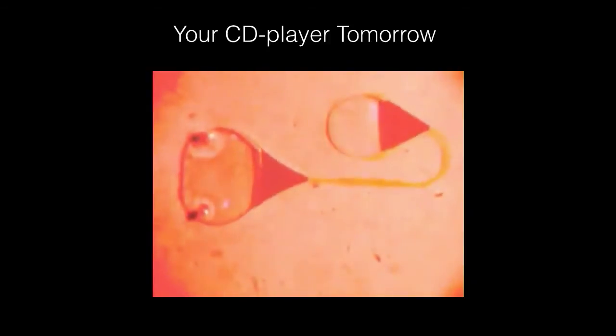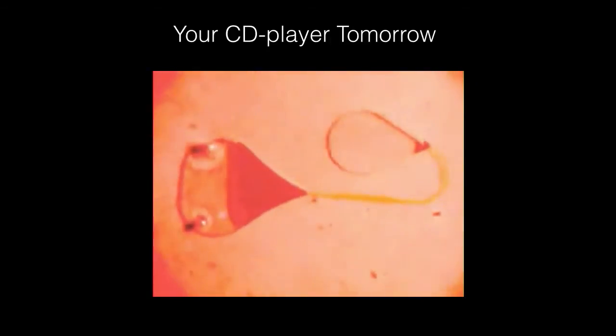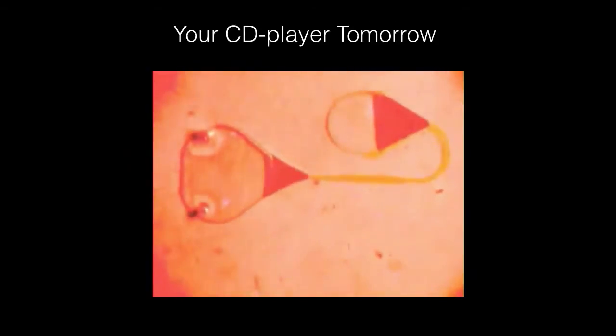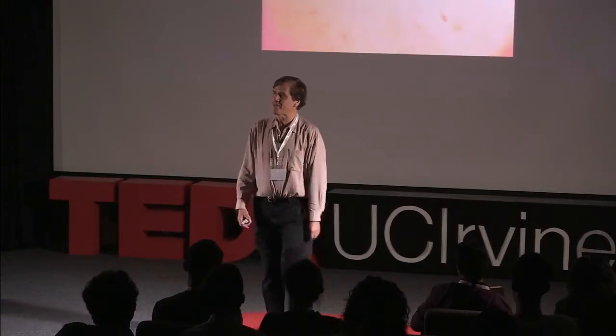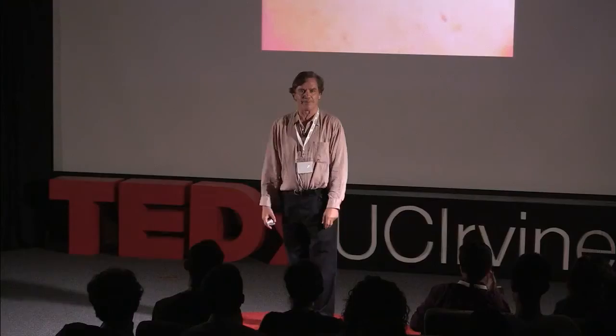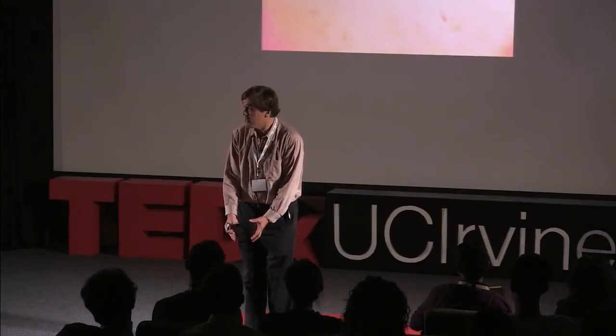The CD player is also a pump. What you see there is liquid being pumped by the CD. This thing is spinning and liquid — mostly water — is pushed by centripetal force to the rim. But do you see what happens? It goes back and forth — it's a reciprocating pump. How is that possible? Over there in that reservoir is air. Here comes my body of water pushing against the air, compressing that air — compressing it more when I spin faster. Then I spin slower and the liquid goes back. I can do this thousands of times. This is a fascinating pump.